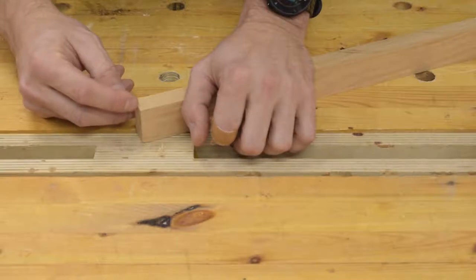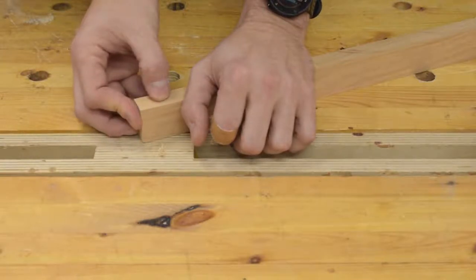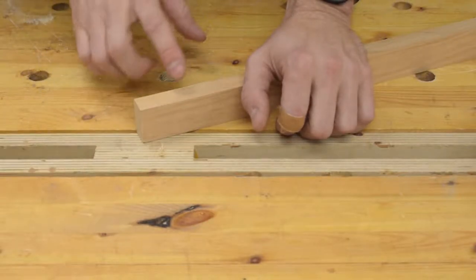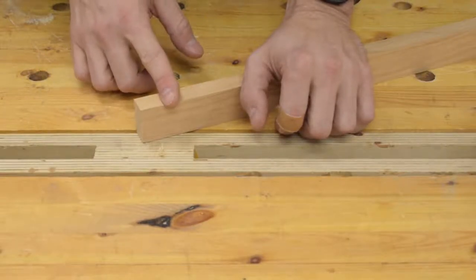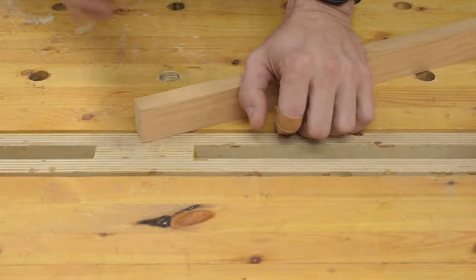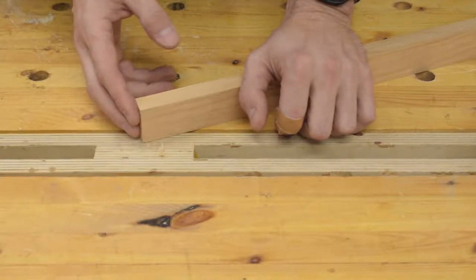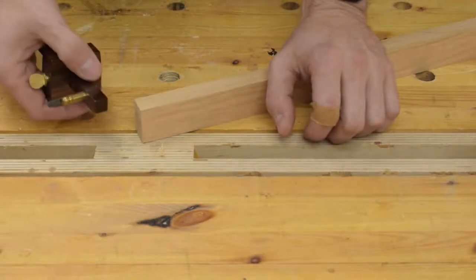So by bringing this up to about 1/4 inch of the top of it, it's going to make it look nicer. Going to establish that clean shoulder across the front, but also it's going to have a very useful effect by preventing the joinery from interfering.